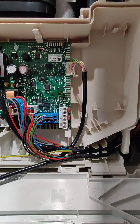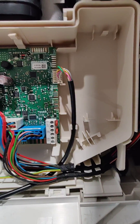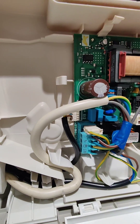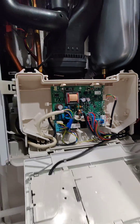This has been going on for a while. The 230-volt contact is there but it's not doing anything, because it's overridden by the 24-volt contact. So all we're going to do is remove the 24-volt loop and it'll be sorted.